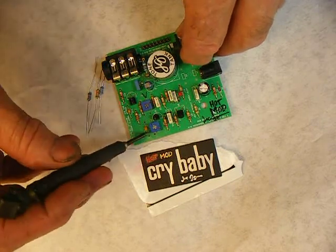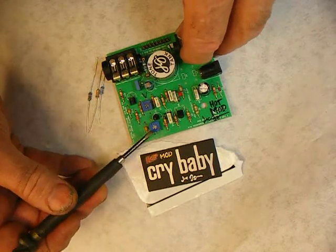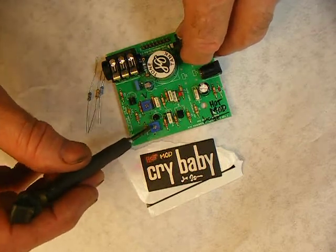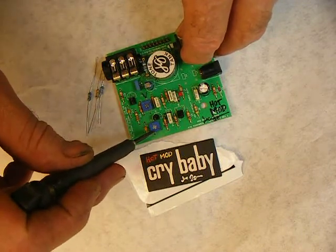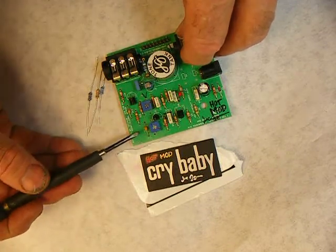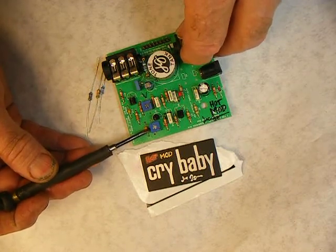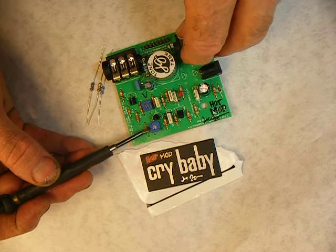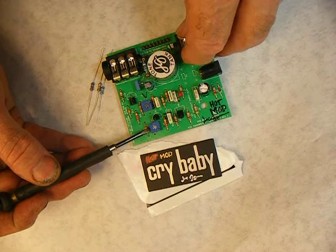This one is also marked — approximately 390 on here. Everything's plus or minus five or ten percent, so those are your baseline starting points. You can make it a lot hotter by turning both clockwise — louder or hotter than bypassed if you want. I often recommend setting the bias first because that adds your lows and sets your growl factor, and then set the volume after. The bias is more key to altering the frequency, distortion, and growl factor, so set that one first.